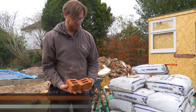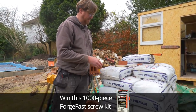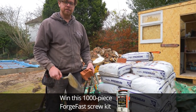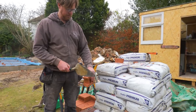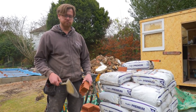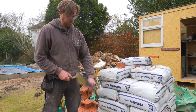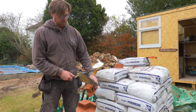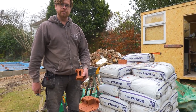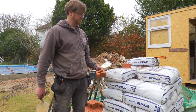Now, just because this is a two minute tip and so far you've been about 20 seconds — can you now take another brick and cut a quarter off it? I can cut a quarter and make a... you'll cut a quarter off that one? I can do it off of that, so we can make a queen closer. That's the one. Queen closer — so we now want that hole there. And there's your queen closer. Oh, that's great. That saves getting the angle grinder out and covering the place in dust as well. Exactly. Nice easy one. Good one.